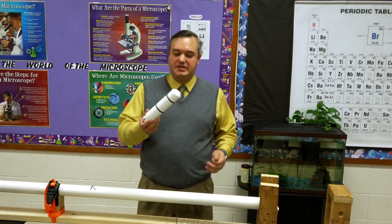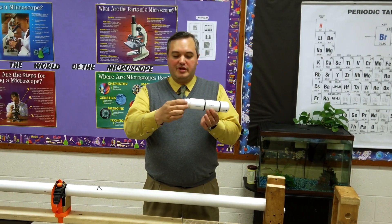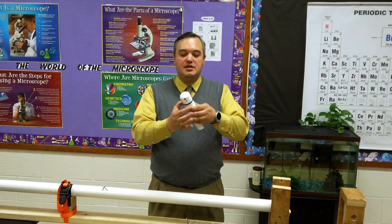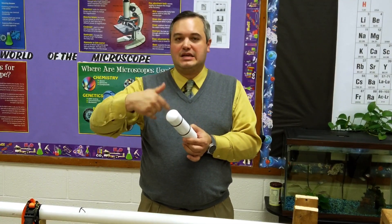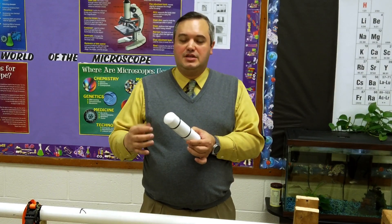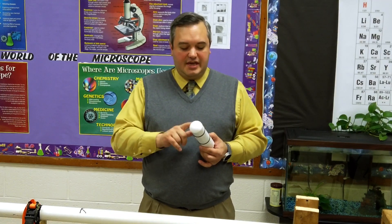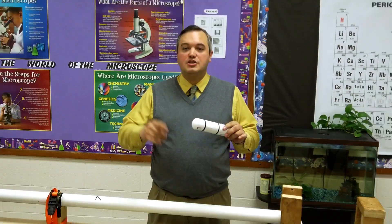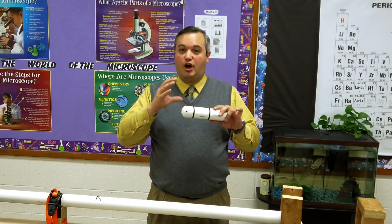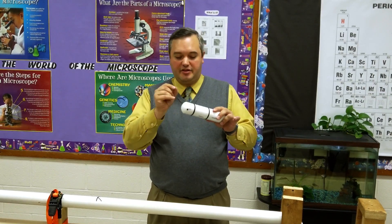On the inside, you're going to use a piston made out of inch-and-a-quarter PVC. You'll glue an inch-and-a-quarter end cap onto the end. You need an O-ring with an inside diameter of one and five-eighths inches and an outside diameter of two inches so that it makes a nice seal inside. The ones I tried first didn't work as well — I ended up ordering on Amazon, and I'll put a link in the description. From that company, you were able to specify all of the dimensions you wanted: the inside diameter, the outside diameter, the thickness, and so on.